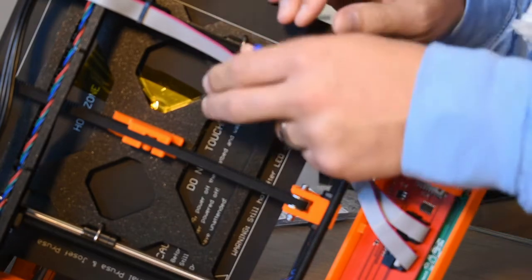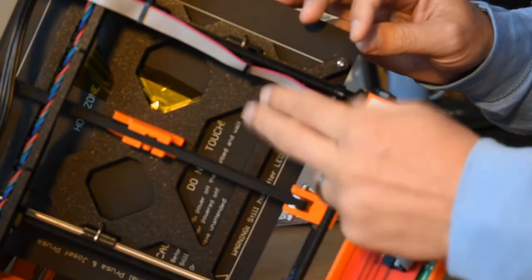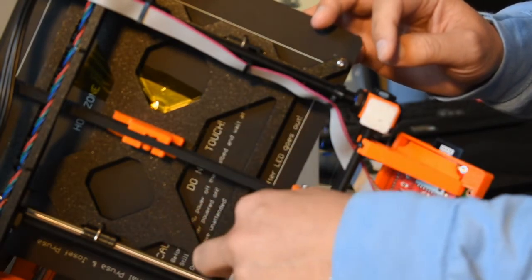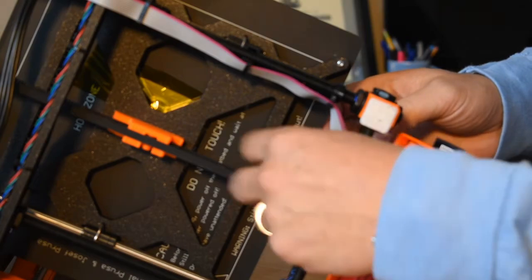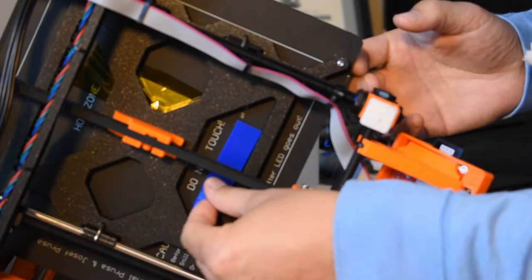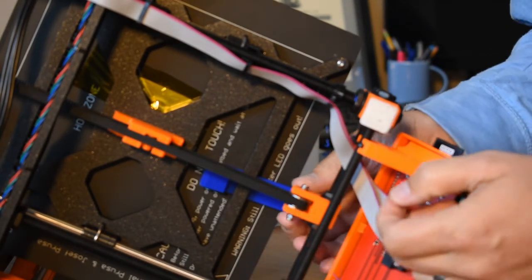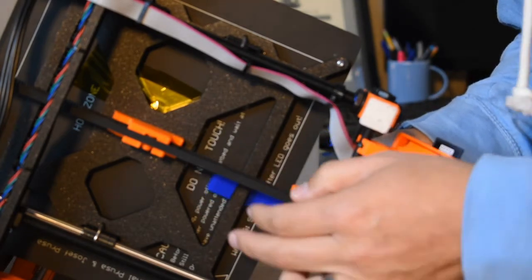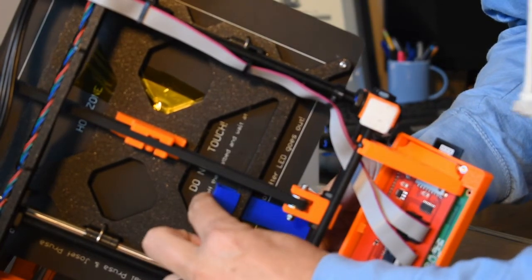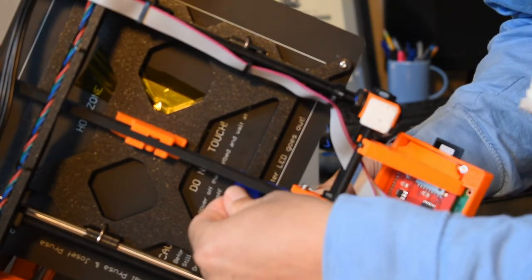Here's the bottom of the printer. This is the frame piece underneath — it's what holds the heated bed to the frame, and this is the Y carriage. I was looking at this bar right here up at the front of the printer. There's a space between the heated bed and the frame. What I do is I slide this clip piece up in here — it's not a tight fit, just snug — and then you pull it forward and the little clip clips on and snaps around the end of the frame. Then I slide it to where I want it.